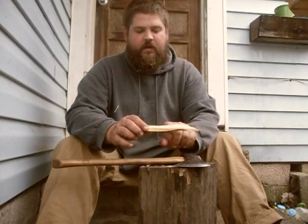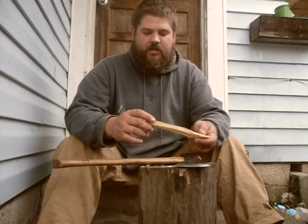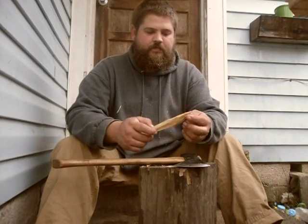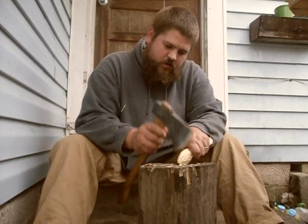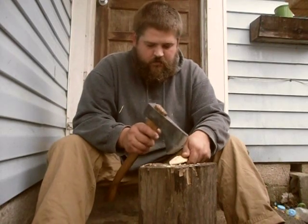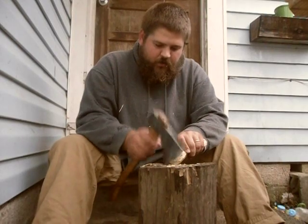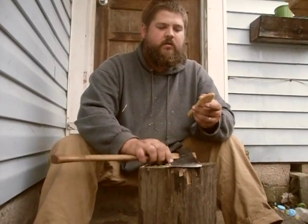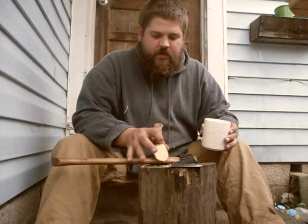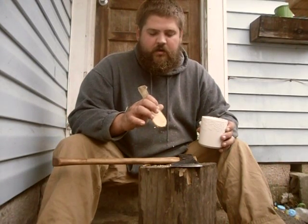This kind of spoon is thick here with a little bit of a spine. What I've been making recently - I kind of like it being thick right up here. You can hold it back where it's thinner, and I like it to flare out at the back, and it needs to be thinned up in the front. I'll cut that off a little bit square because I don't like it going out so pointy. I want more of a real egg shape where it's towards the handle. Think of an egg - it's going to be fat on the bottom and have one side that's a little bit more of a pointy transition. That's what you want on your spoon bowl. I don't do round spoon bowls because I use a gouge - I don't have a hook knife. I want it fatter on the bottom end and come into more of a point down on this end.